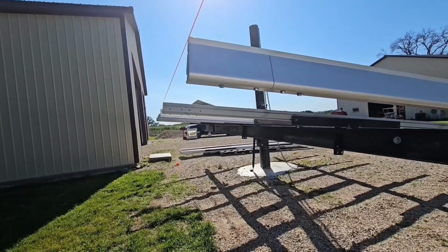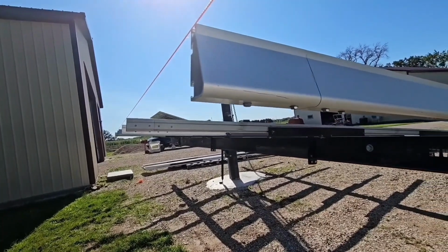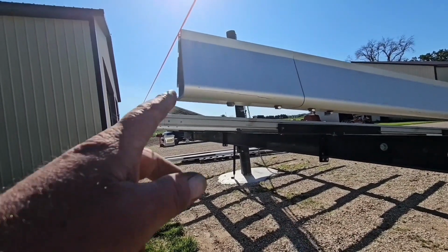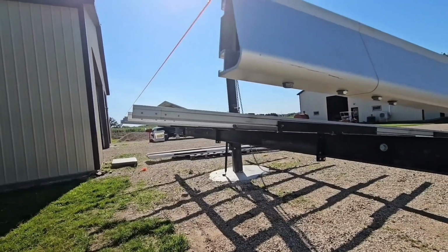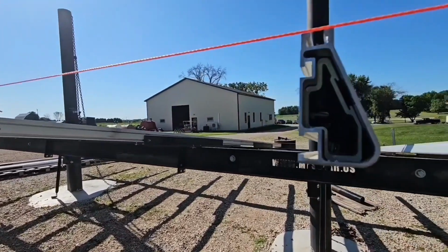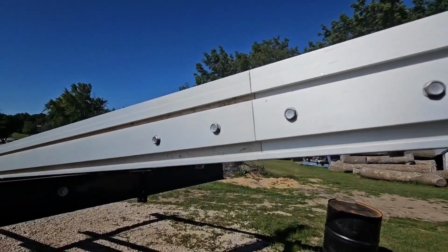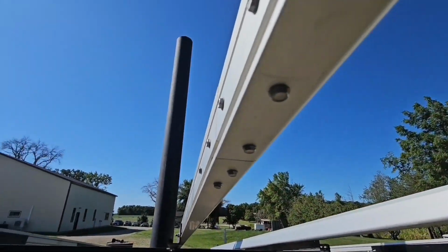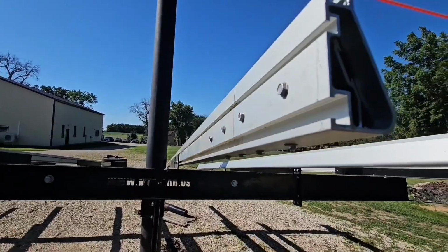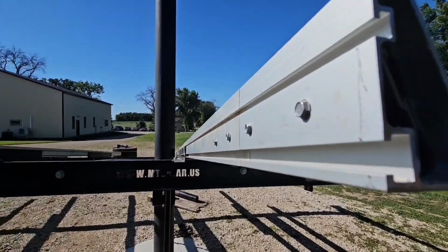So they sell a splice kit, and of course they tell you not to use it on a cantilever, but I'm only like 6 inches long here. I used my 38-inch long pieces, cut it up in the bandsaw, and so your splice is inside. I run 4 screws on this side, and I did run 4 screws in the bottom. These maybe ain't needed, but you know, I said, oh, what the heck, you know. Stainless, of course, which brings us to another subject.